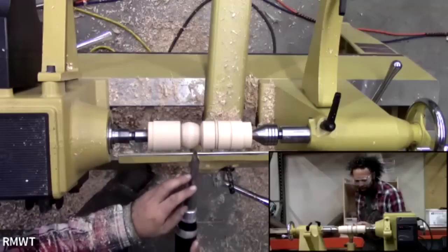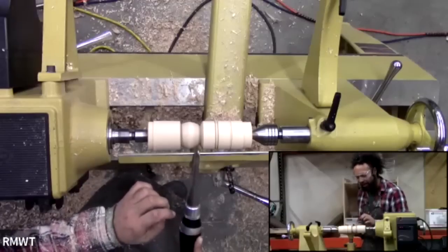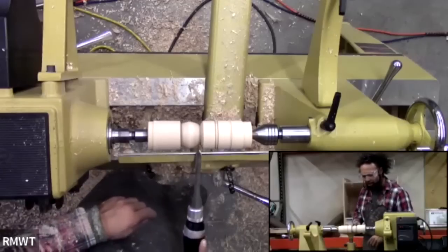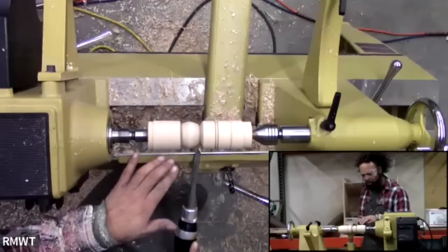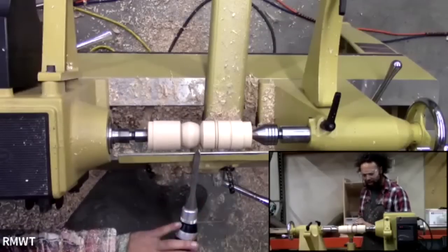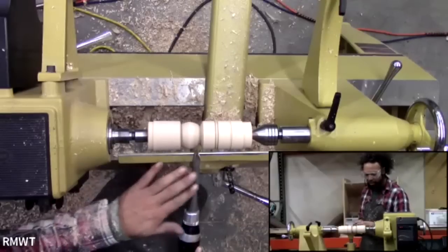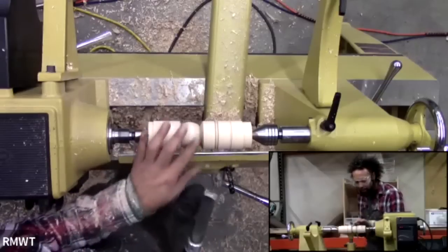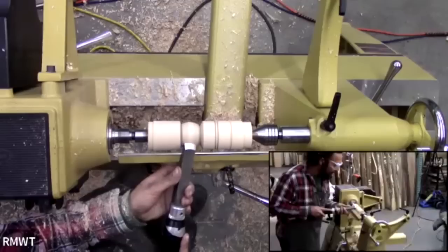You'll see often that when I'm using the skew, it's more commentary. The finesse is more commentary again on the tool not leaving the side, so I'm not over here. There's no gap. I always have to make sure that when I bring the tool in like here, if I have any other point of support on the tool, it's not back here. If you're below the ferrule of the tool, the tendency is that you're just pushing into the fibers. You have to make sure that there's finger support, and also that there's usually a point of contact on the tool rest. So if I go ahead and start over like this, oftentimes you'll see that I'll go underhand,